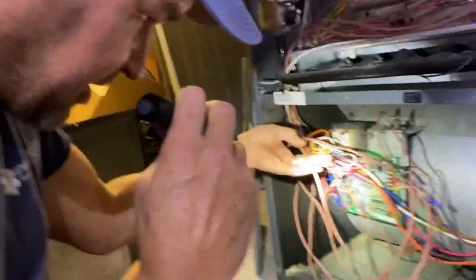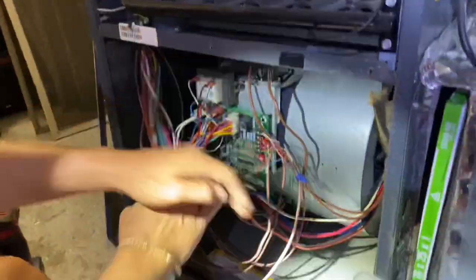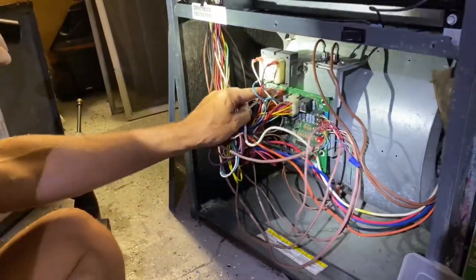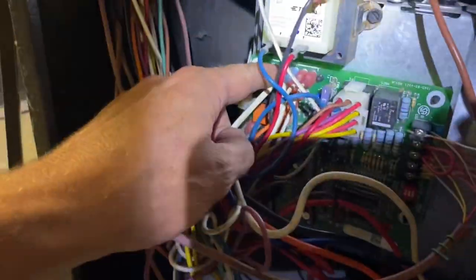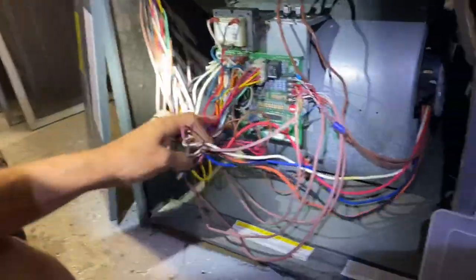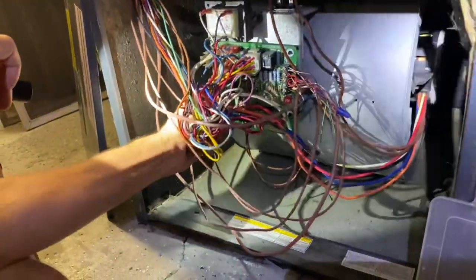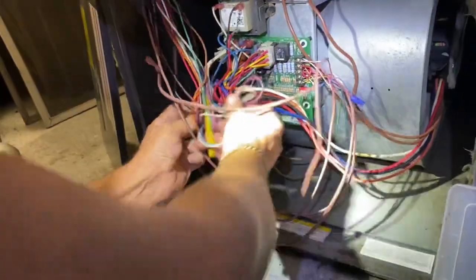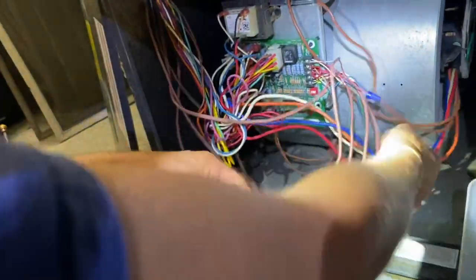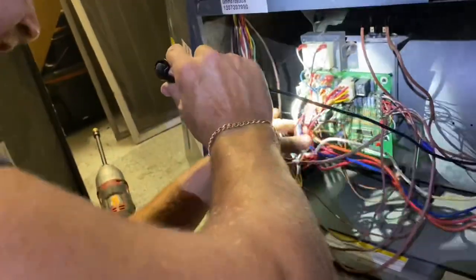That's very weak. So let's deal with this wire. White is always neutral, which goes to that neutral bar — see that? There's a bunch of neutrals there. The condenser motor has a neutral, they all have neutrals. Now the black wire is fan high, which is going to go down here. So let's take this one out of there. Now if we apply power to this, it should come on. So let's find line.